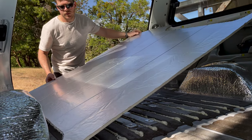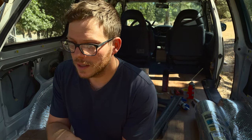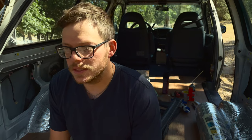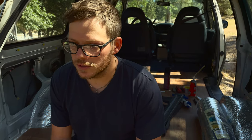Do it first and you'll make sure you don't have to cut and recut and measure multiple times. Mistake number three: do not use spray adhesive under the poly iso prior to installing it. When you put the great stuff expanding foam underneath, it causes a slight raise in the poly iso, rendering the spray adhesive useless. So don't spray it underneath — there's no need, you're just wasting spray adhesive.